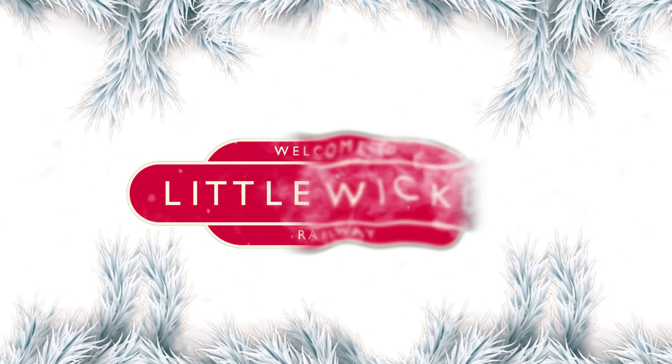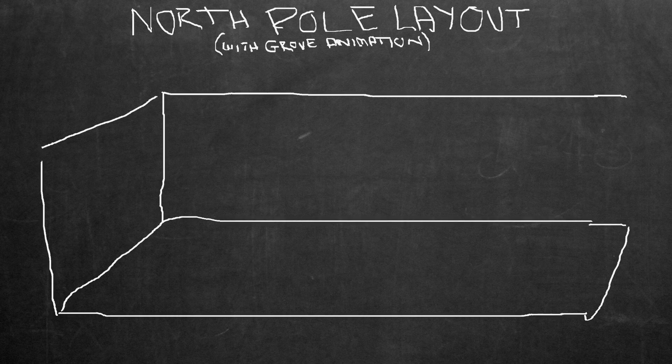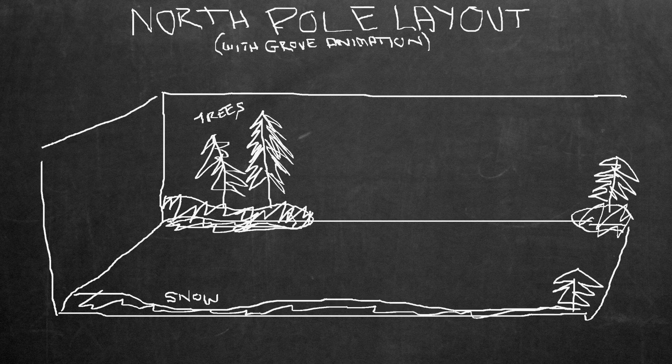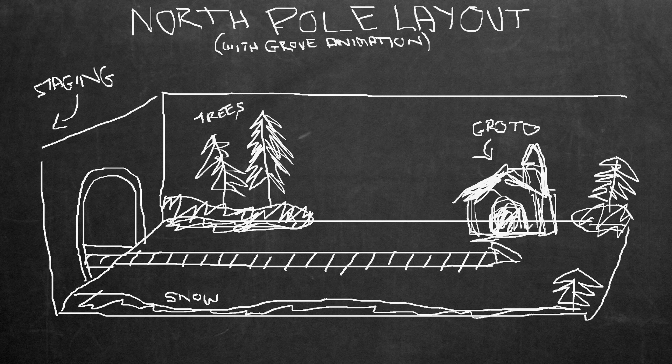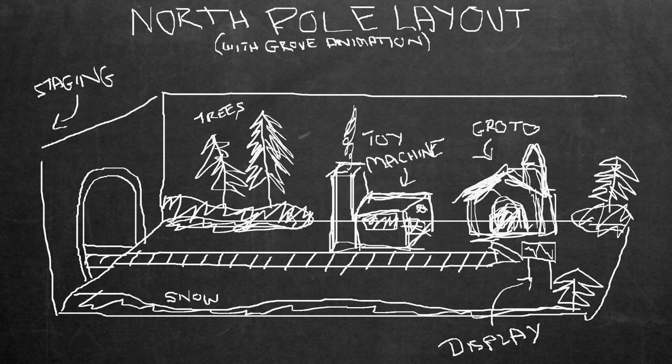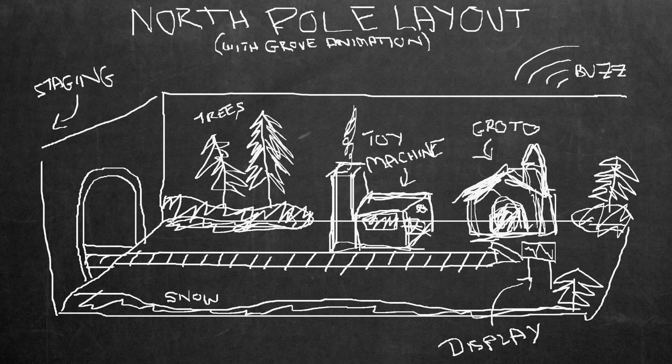So here's my plan for Santa's North Pole layout. It's going to be small — less than a foot wide and maybe two to three foot long — divided down the middle. One side will be decorated, the other side will have some hidden storage, and there'll be a tunnel portal in the middle with a short stretch of track. We'll have Santa's Grotto with the OLED screen showing train arrival details, a toy machine with the water atomizer pretending it's steam operated, and a motor turning some cogs. The Santa Express will back in and we'll use the ultrasonic rangefinder to detect when the train is in the right position. That'll activate a buzzer and light on the toy machine, and the servo will then tip some presents from the toy machine into the wagon.